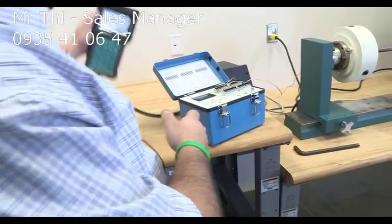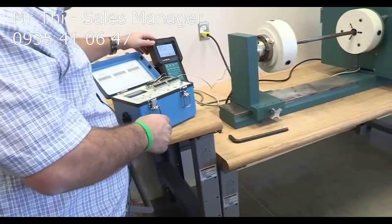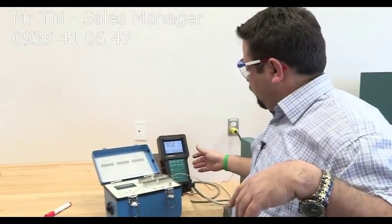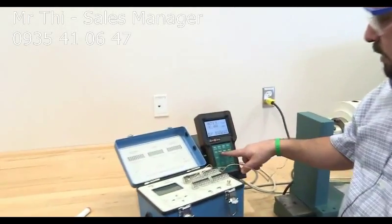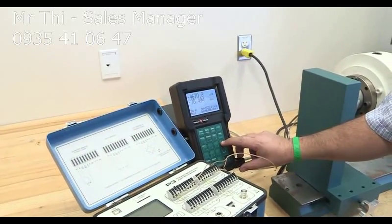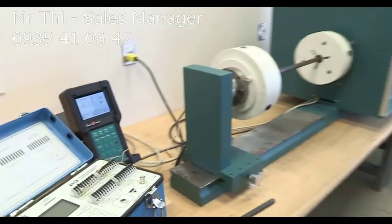And the way to do that, I'm going to put it back here. If you want to go a little bit faster, because at some point you will lose the strain gauge, because the strain gauge does not elongate a lot. So you're going to lose the strain gauge. If you want to go really fast, you can hit this twice. So 1, 2, and now it's going really fast.